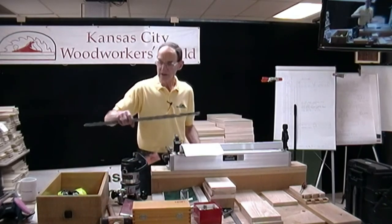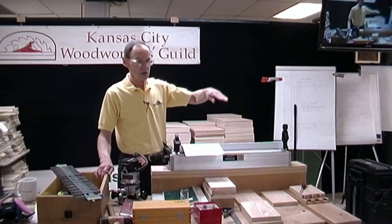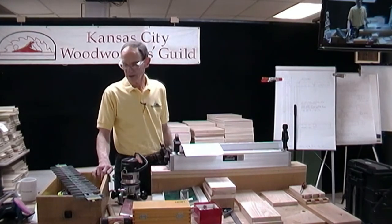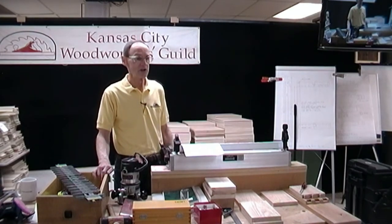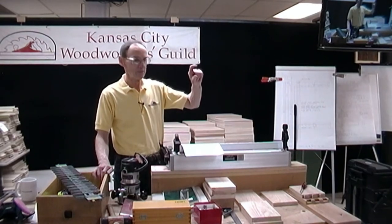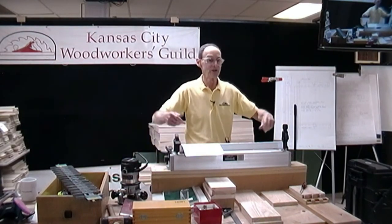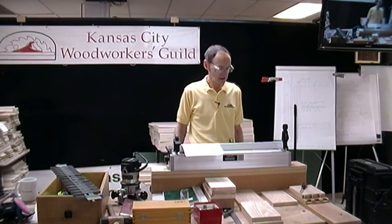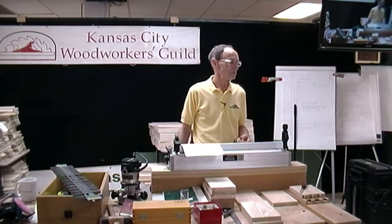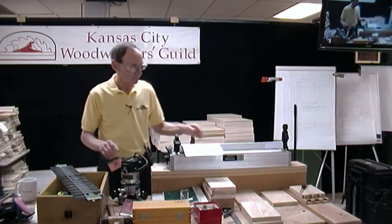And if you think about it, the dovetails that you have on one side of your drawer don't have to be symmetric from top to bottom. They don't have to be the same size at all. You could have tails closer together up here than you do down below. You could have big tails and a little tail, because every time you make a change, you're just flipping side to side. And what you did to that tail is going to happen when you cut the pin as well. So it's pretty flexible in that regard.